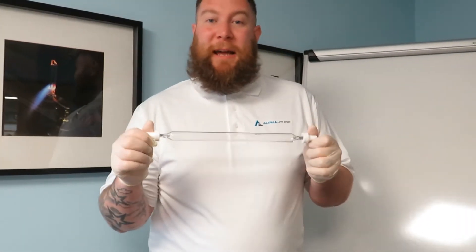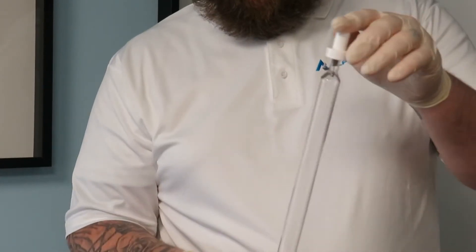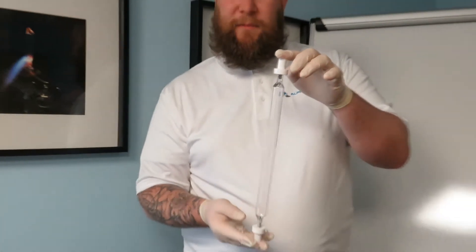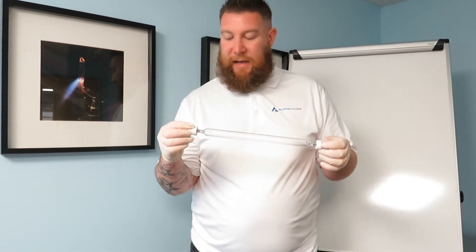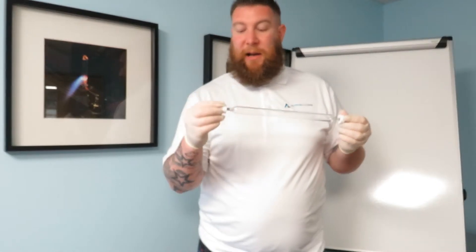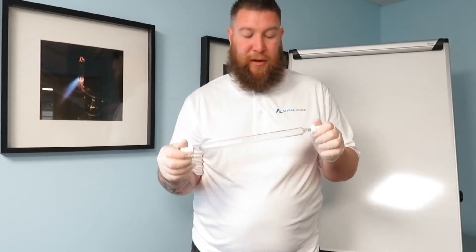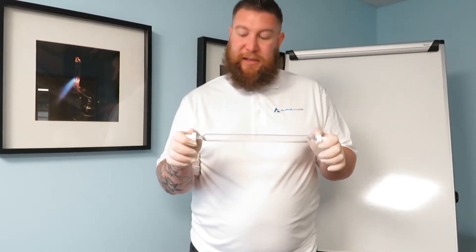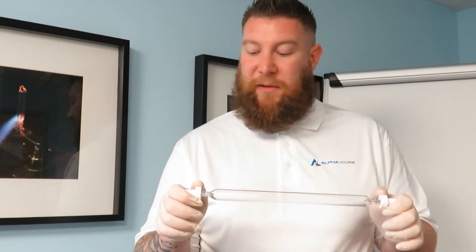Clean the lamp regularly when you maintain the system. This will help to keep it clean and will also help with the UV flowing through the lamp. You won't have as many issues with heat. Always, if you can, wear gloves as I am, and try to use isopropanol alcohol and a lint-free cloth. Don't touch the lamp body with your fingers because that can leave a mark on the body, which then makes it the weakest part of the lamp and can reduce the lamp hours.